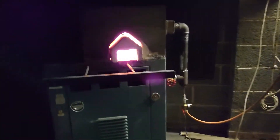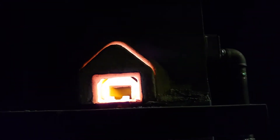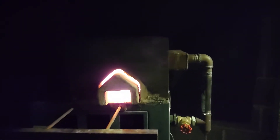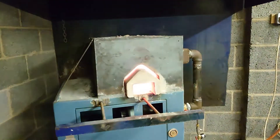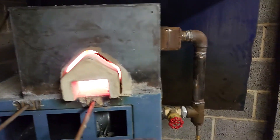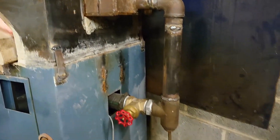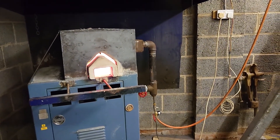She's running and pretty warm in there. You can't quite see the burner because the camera can't handle it, but she's on tick-over at the minute at 7 PSI. Flip the light on and you can see she's drying out. We put a few vent holes in the casing - that stops your stuff from cracking as much and lets the steam get out. There's a bit of condensation around the sides, mainly condensating off the ribbon burner body. Job's a good one.